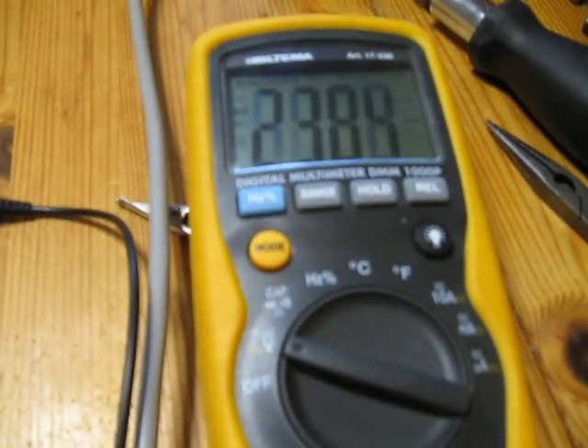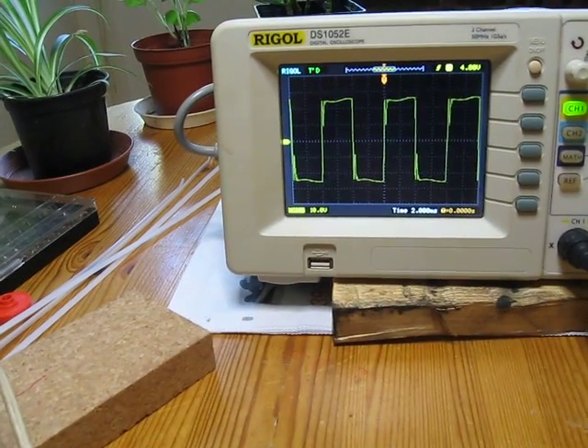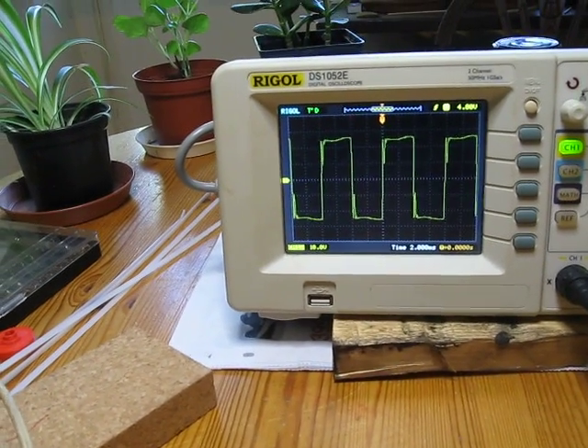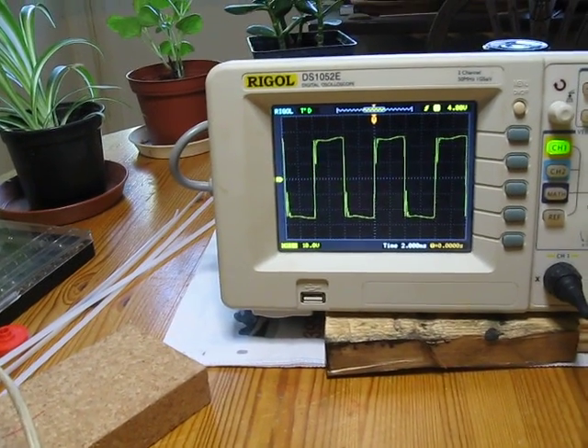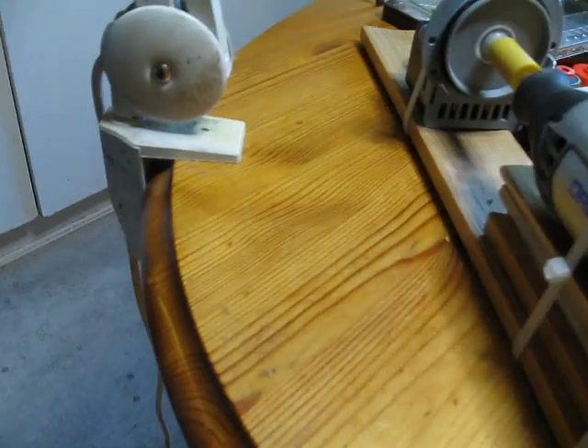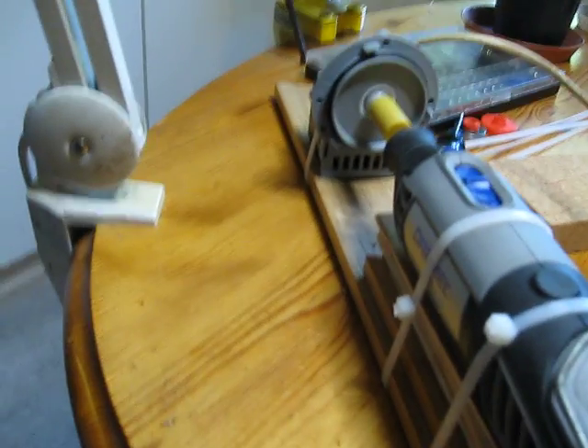Okay, so that's 230 volts AC. The frequency now is like maybe 125 hertz or something, which is a bit surprising to me, because my RPMs now should be like around 1,300 RPM. So I'm a bit surprised I have this high — pretty much over 100 hertz.